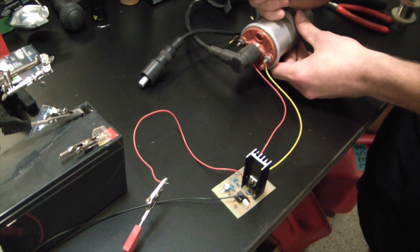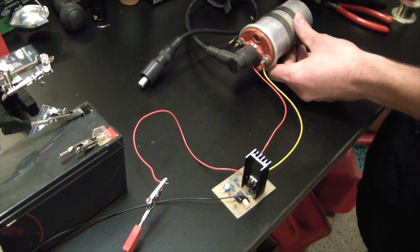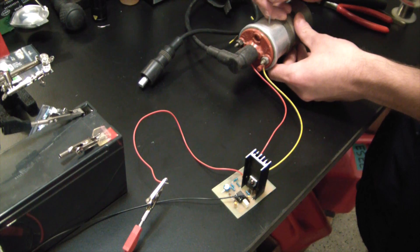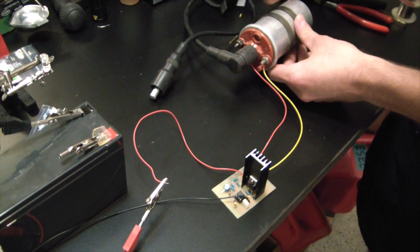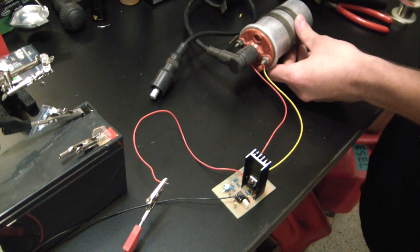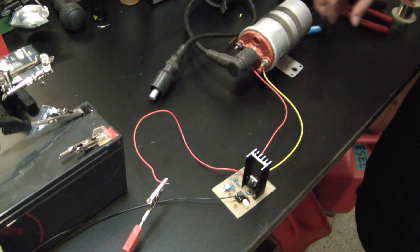What this big inductor here is doing is creating a huge voltage to try to keep its magnetic flux, and that huge voltage spike comes out here. It's pretty damn cool — that big flux is seen in the secondary coil. That is how she works.